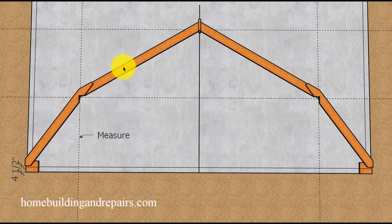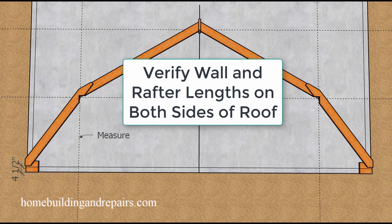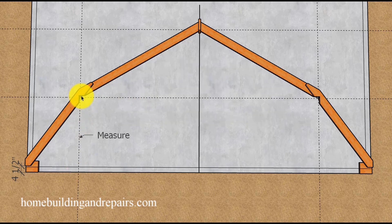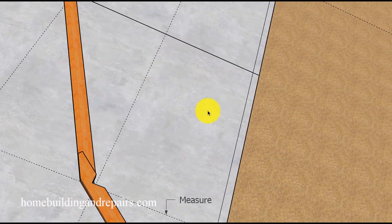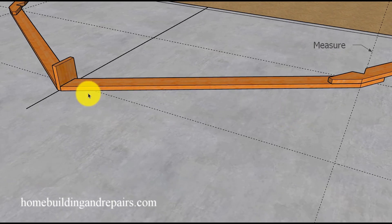You could also cut two more roof rafters and position everything to measure accordingly. You will also need to measure the distance from the top of the line to the bottom corner of the roof rafters to figure out the wall framing height. You can use this to figure out additional parts — for example, the height from the bottom of the ridge beam to the top of the wall framing — saving a lot of time if you don't understand complicated roof formulas.